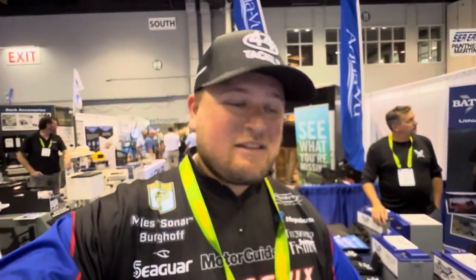But honestly, after using them for all these years, the weight is actually one of the lowest priority features that I enjoy about them. One of the things I've seen is a lot of people go into all-in-one 36 volt systems for their trolling motor, which makes sense. You have one battery that can do it all. The problem is that a lot of times people need multiple of those 36 volt batteries, which is very costly. You're just adding more batteries to the system, and you often can't run them all day in heavy current or through grass flats and have them last the entire day. A lot of times guys have to switch over to their second 36 volt system.